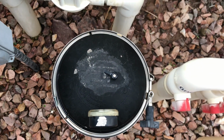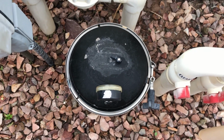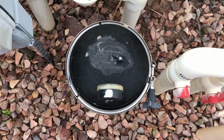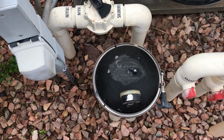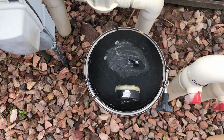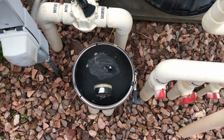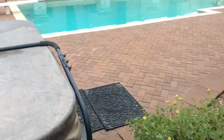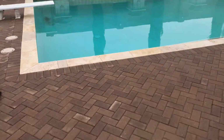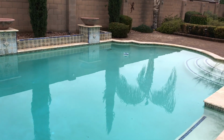This one gets a little trickier because if I'm doing a vacuum conversion in a pool, I want to make sure that the pop-ups aren't coming open somewhere and creating a hindrance that the vacuum is going to run into. So I usually have to set it, find where it's coming up through the steps, and then lock it down there. So what I'm going to do is run the system, and I would come back to the pool. I'm going to turn it on right now. Okay, and we're coming back to the pool, and you'll notice the pop-ups are starting to run here. I don't know which one's opening yet. Let's see. The pop-ups on the far end of the pool are opening up.